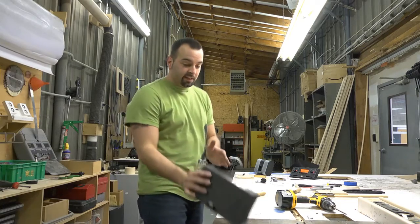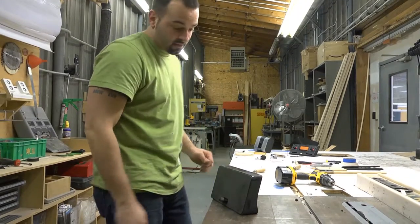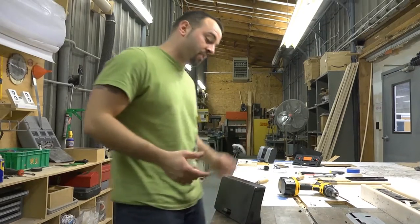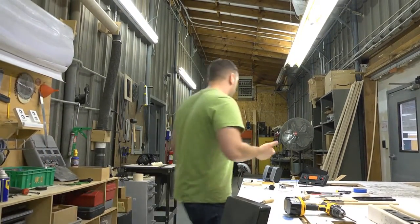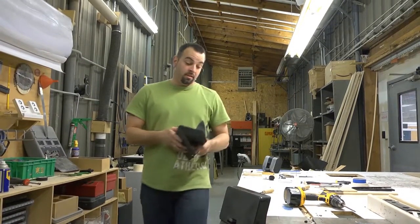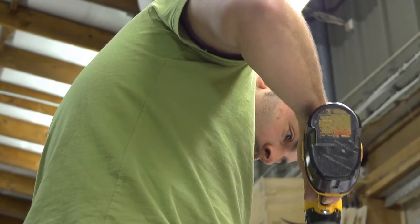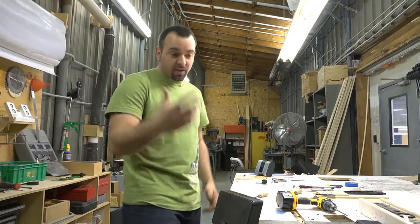If this box is actually loose and it's contracting like this, when there's bass in there, you're going to lose bass. If it is doing this, you can actually squeeze the cabinet and hold it, and then you'll actually hear the low frequency pickup just by making this thing tight. So a lot of our products, you can see underneath, you actually have a lot of screws that hold it. So this thing front to back is tied together so it's not going to flex. Making the box so it doesn't do this doesn't cost you money in speakers or electronics. It's free. If you do that right up front, you're going to get a better product all the time.